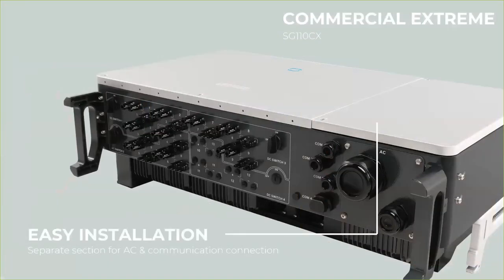Here you can see the panel on the bottom of the inverter. On the left-hand side are the MC4 connectors, and each three MPPTs have their own DC switch. This helps to use smaller, less expensive DC switches — you could use one big DC switch to disconnect everything at once, but for high load that would be very expensive. Using three separate DC switches helps keep the cost down.